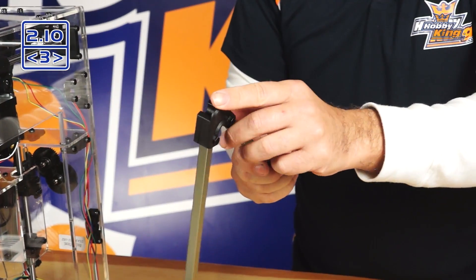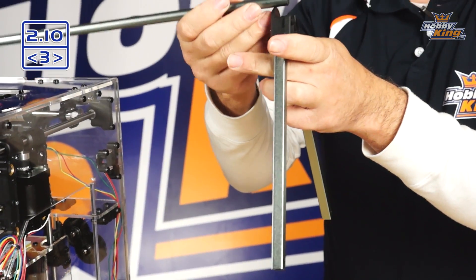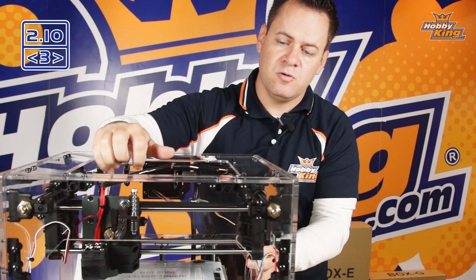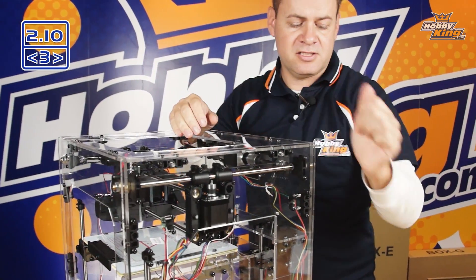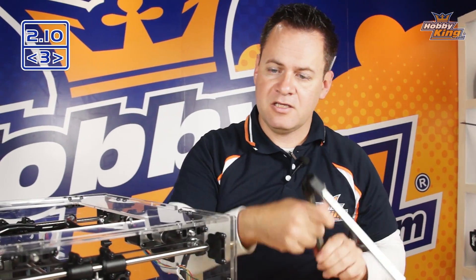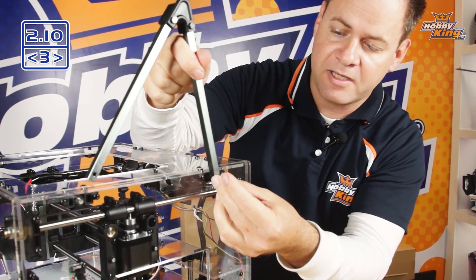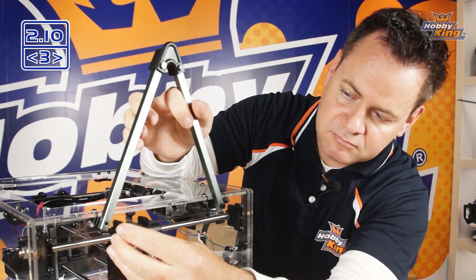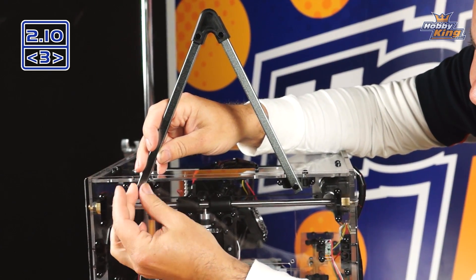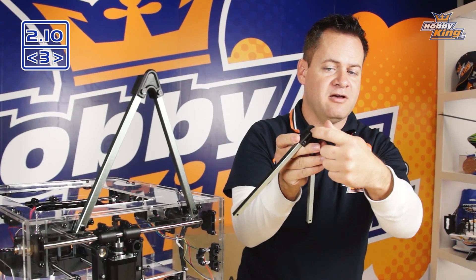When you hold up this arm, it's got a lip on one side and a flat on the other side. This lip goes towards the outside because the rod lays in it this way — so don't install it the other way, that obviously won't work. Along the side of the printer, you've got two holes right up here on the top, and there are already blind nuts installed right over there. In that box you have the hardware — just grab two of the bolts, lay the arm up, line it up with that hole, and get it started by hand. Do the exact same thing to the other side, just noting that lip so you get the flat towards the inside.